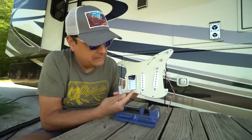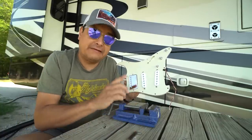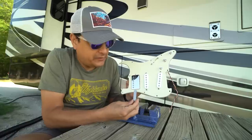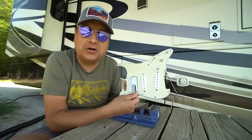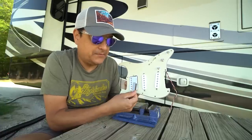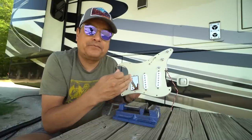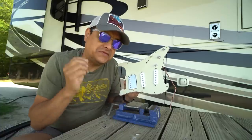What DOES affect phase is if you take the magnet out and flip it over, running the north side one way and the south side the other — now you're out of phase magnetically. Magnetic phase means changing the polarity by flipping the magnet over inside the pickup. For example, if you have a Les Paul and you want to do the Peter Green thing, you take the pickup apart and flip the magnet over. The pickup will still sound the same on its own, but when combined with another pickup whose magnet is the other way, it will be out of phase magnetically.